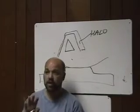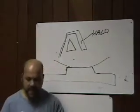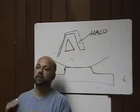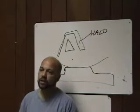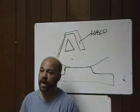We've all observed that halo around those letters - that's the result. In this case it was excessive. We could improve it - not too much - but we can try by backing out the impression. However, the reason I like this sample so much is because it also illustrates another defect that is not as apparent. When you learn to identify the telltale signs it can be a great tool, because it can cause a lot of aggravation - you think you're solving it by adjusting impression but you're not.